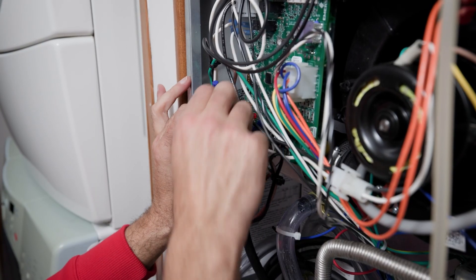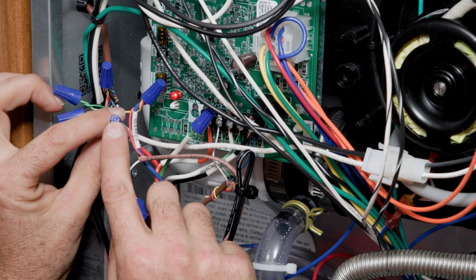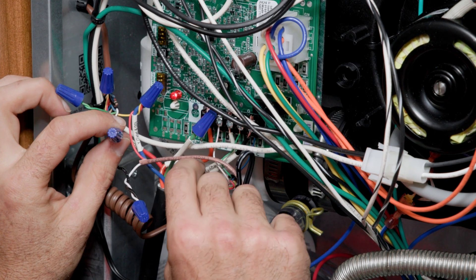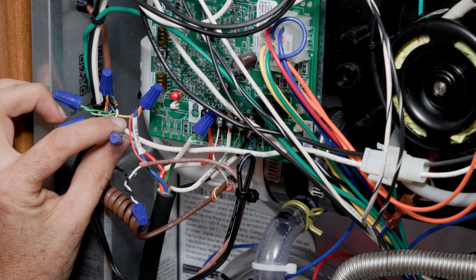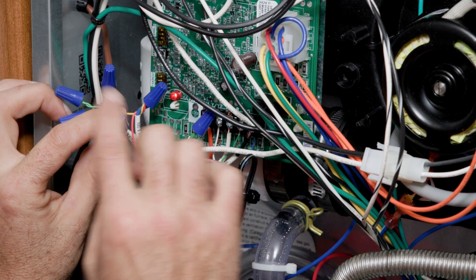The next wire is the red wire from the refrigerant sensor, and that goes to the red wire from the thermostat. We bring the power on the white wire from the R terminal on the control board, that goes down to the sensor, and from the sensor we are returning 24 volts to the thermostat.